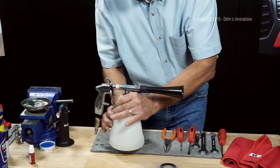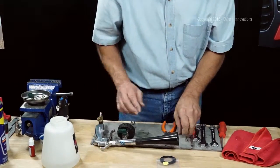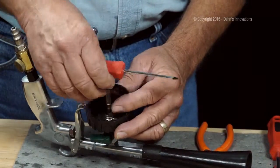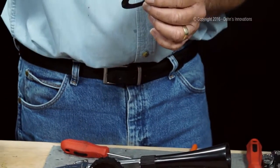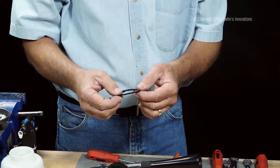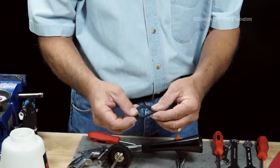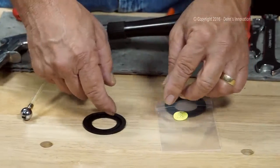Take my jar off and set that aside. Underneath the cap is a flexible washer — this is what comes from the factory. They put a flexible washer in there because they feel it's like a paint gun; you don't want to turn it upside down to paint. But in our situation, a lot of times we have to put the tool in a different position — under a seat, door jam, or what have you. This is a very flexible type gasket and it's got a little ridge underneath here.